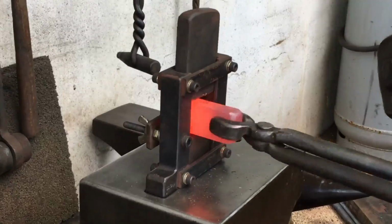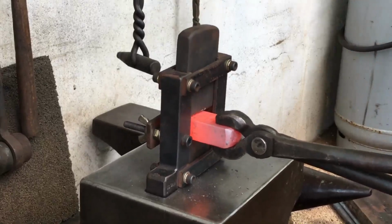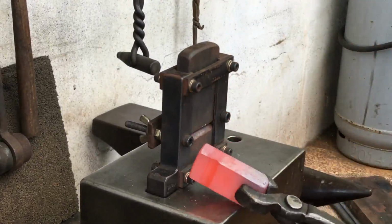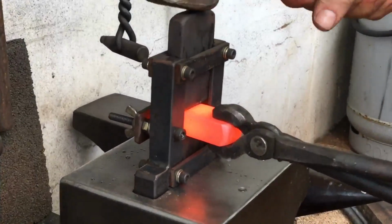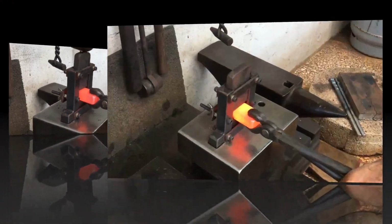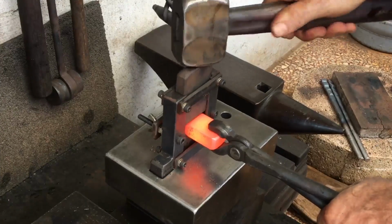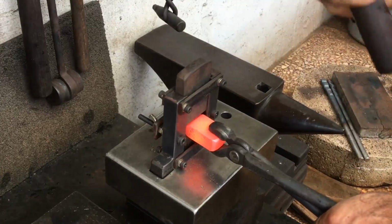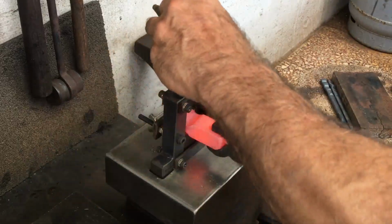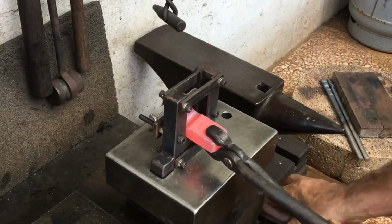Whew, boy, this steel is hard, and this is going to take a few heats. Also, I need to get it to a higher temperature. You'll notice that I'm very deliberately hammering and holding down on the downstroke, and that's the reason why. As this steel cools, it has so much spring. I can make this thing pop out just like that.